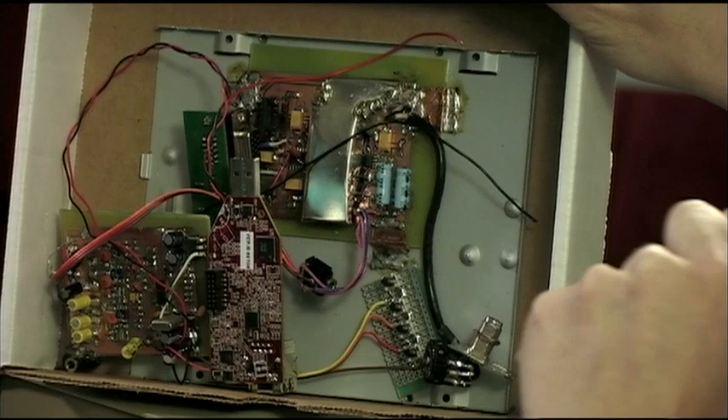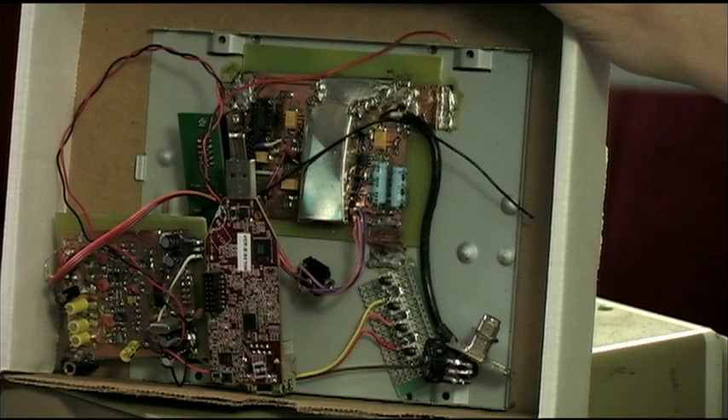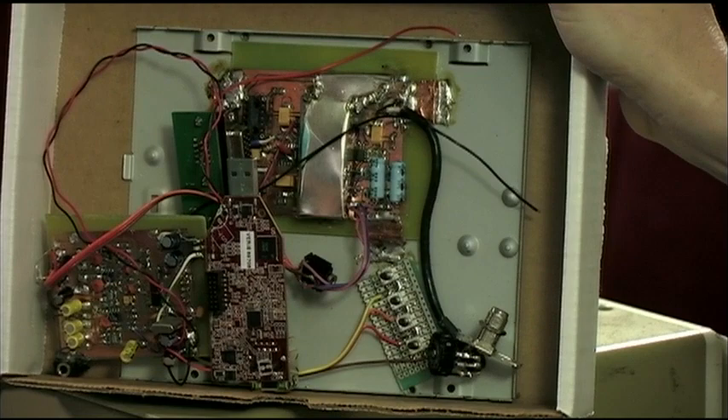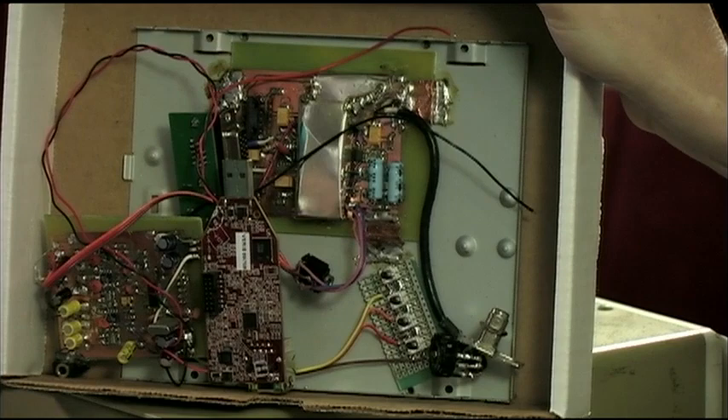You hear the signal — that's so much better than blindly turning a knob and listening. You can just look at the spectrum. I have YouTube videos of it on my Jerry Ellsworth Jabber YouTube channel. The output of just the analog board alone can go directly into your Mac or PC through your sound card — you can sample a certain bandwidth, like 92 kilohertz around your center frequency, see all the stations within that range, and just tune to it. That's super cool.